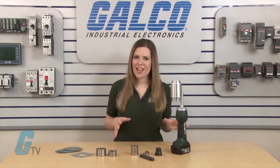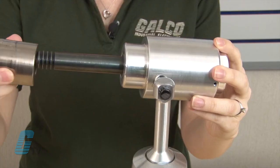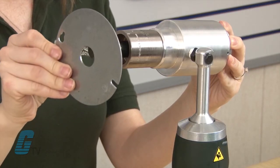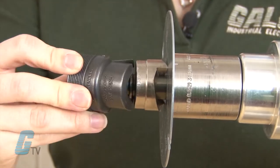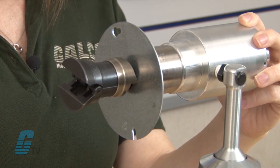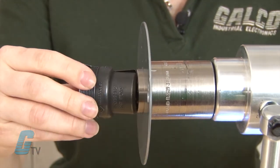The speed punches are faster to set up compared to conventional punches. The beginning set up is the same — I can assemble the driver with a draw stud, then the die and place this through the pre-drilled pilot hole where I want to make my punched hole. Conventional punches need to be threaded on and installed, whereas the speed punch simply slides on the draw stud and then the speed lock can be clipped in place completing the installation. There is no need to tighten or untighten the punch with this system, which allows for greater efficiency while reducing strain on the operator.